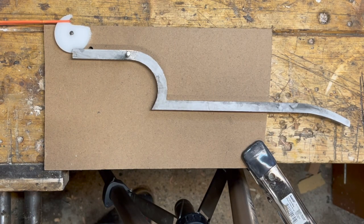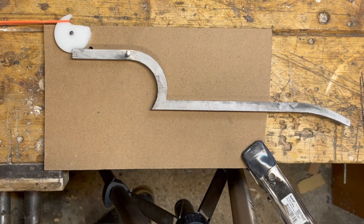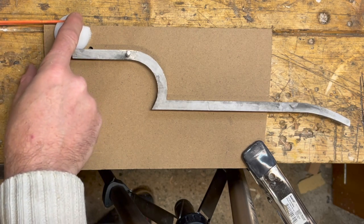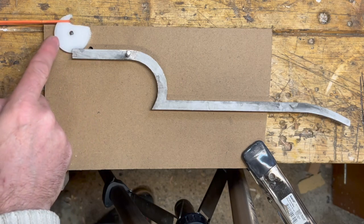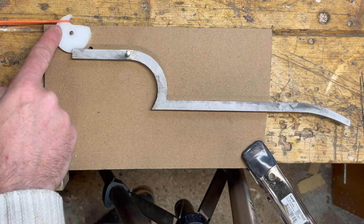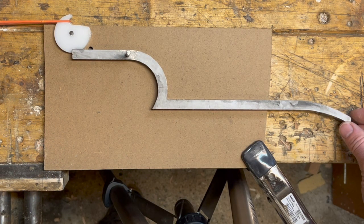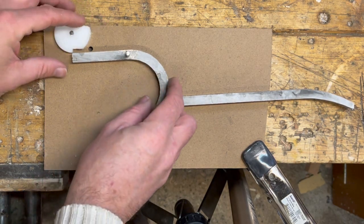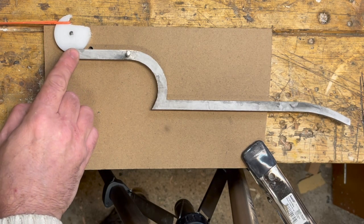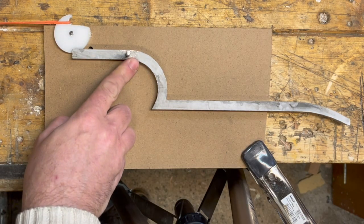As you'll recall from previous videos, the single axle lock mechanism — the single axle referring to the axle on the trigger lever — is very simple to operate. You've got the spanned crossbow, so the string is secured here behind the fingers of the nut. The entire weight of the draw weight is transferred to the fingers of the nut, and this is transferred into rotational force because of the turning axle. So really all that weight is pushing against the end of the trigger. The way it operates is you simply push up on the end of the trigger and that releases the string. The only force the trigger is working against is the rotational force creating friction between the end of the trigger and the notch in the bottom of the nut.